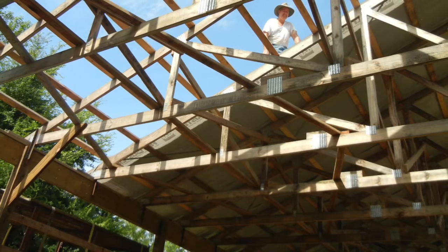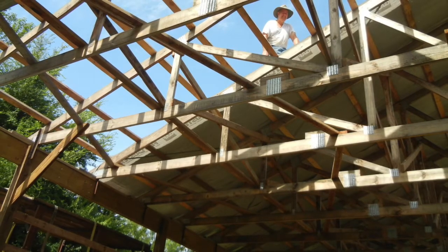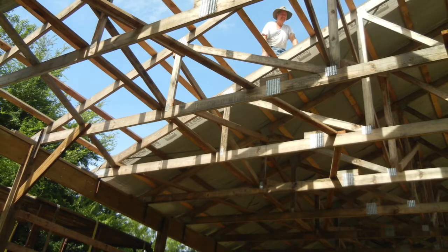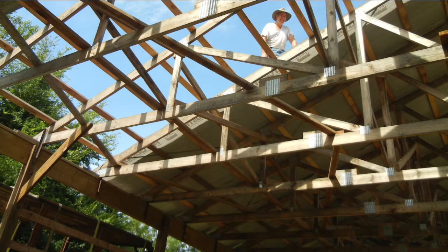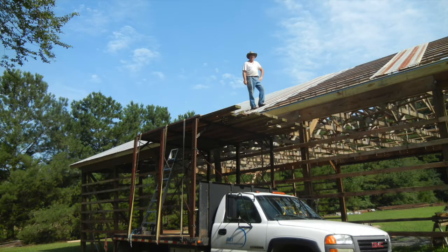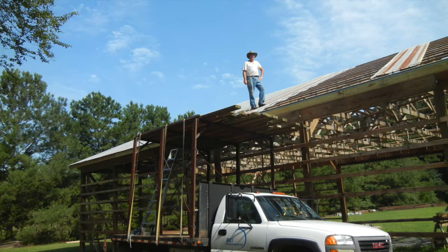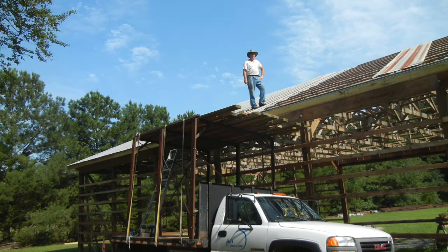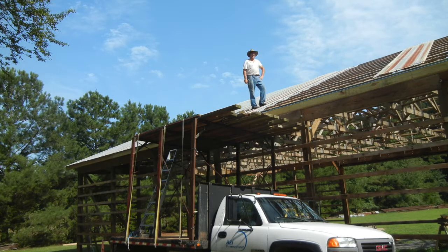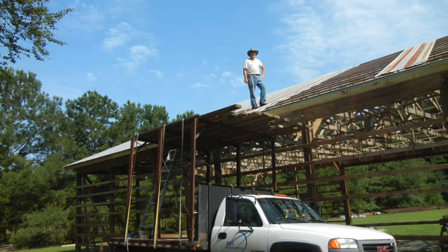All the 6x6 vertical wall timbers and upper banding boards were of new treated lumber, so I wasn't worried about them. They could withstand getting wet. However, the trusses and the roof bracing were not treated, and thus they were susceptible to the elements. So as soon as they were attached to the structure, the pressure was on. I had to get that sheet metal on the roof as soon as possible.